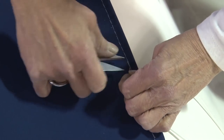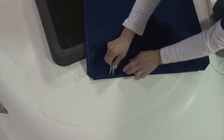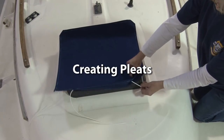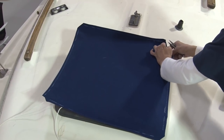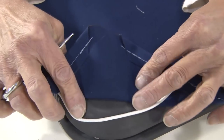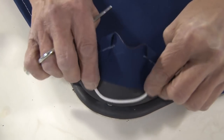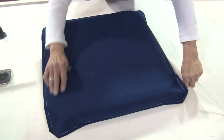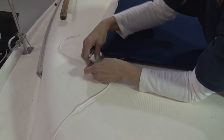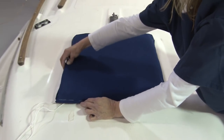We're back on the boat and now we're going to cut out that excess thread. You can leave that thread in or cut it out as Deb is doing here. Now we're going to determine how to create the pleats at each one of the four corners. We have the loops that go right underneath the hatch corners. You need to mark your five inches because you need at least that much of the leech line to catch — if you use less, it's going to pop right off. In order to position the cover for pleating, we pull the line fairly taut so the cover stays in position while we create the pleats all the way around.